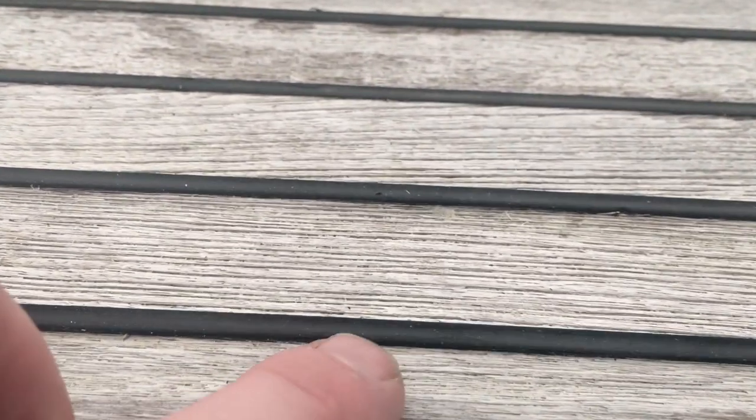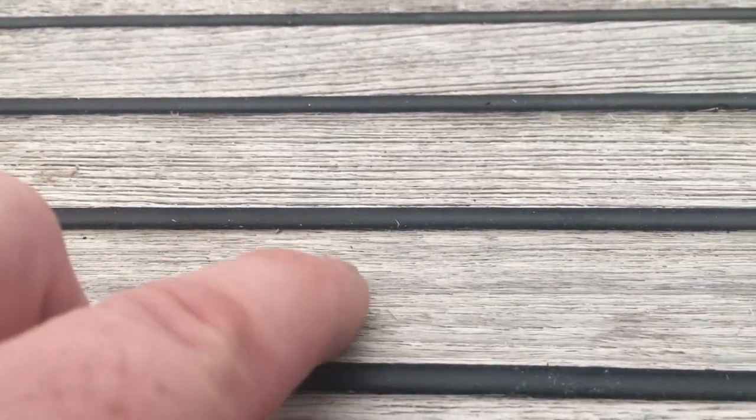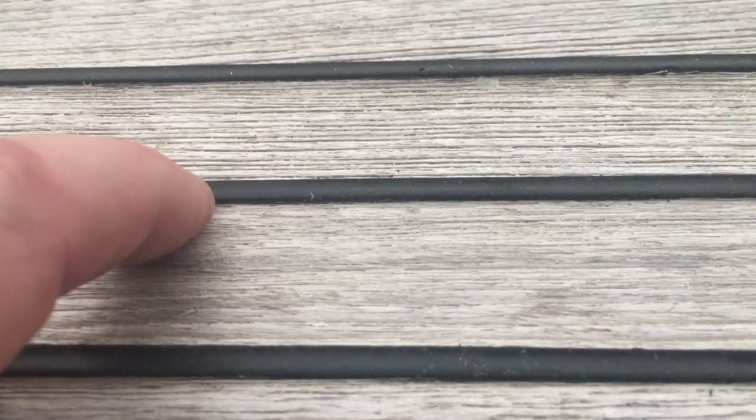Okay, so you get this thing where the caulking, which is on a Najad or a Rassy boat generally, I think this is a silicon based product, and it's very hard wearing, rubbery, and my boat's nearly 10 years old, and what happens is the teak wears, it just gives off surface because it's quite soft, and then you end up where the caulking's standing proud, maybe by about, in my case, no more than a millimetre, maybe a millimetre and a half maximum.